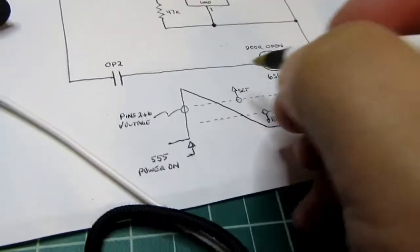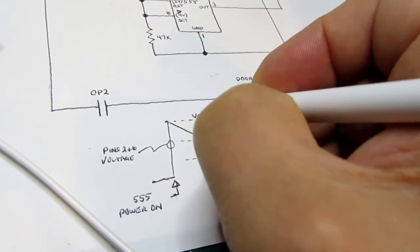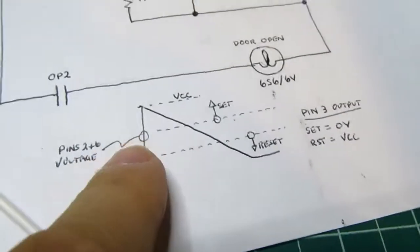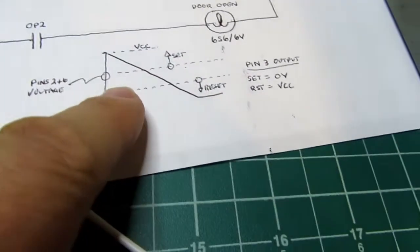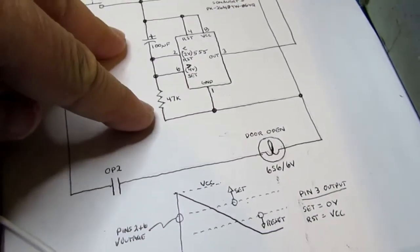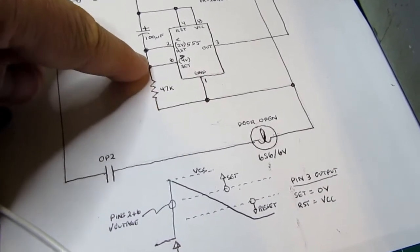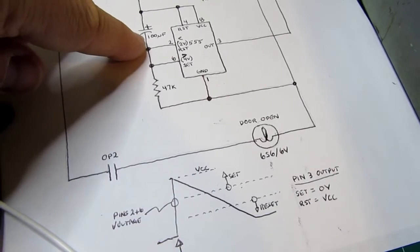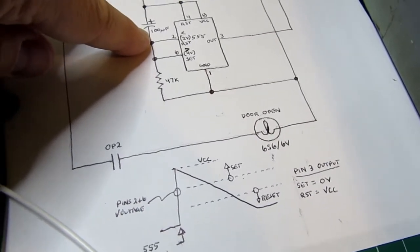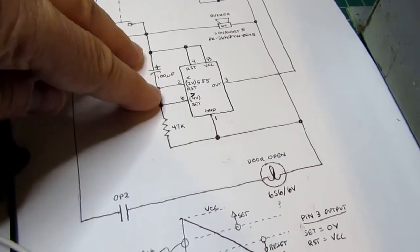As I mentioned, the capacitor initially looks like a short circuit, so the voltage is yanked up to, I guess I can add the mark in here, VCC. It's pulled up to approximately the VCC voltage, and then it starts charging. So current is essentially moving through this resistor to charge the bottom side of the capacitor.